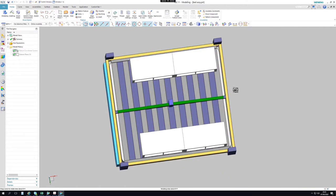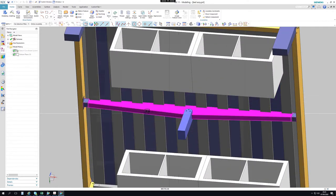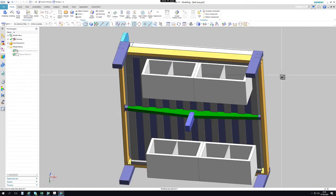We've got full length slats which run from here to here, and the central beam that supports the slats. What I've done is run the slats across first, and then I put this beam and pushed it up against all the slats. Then I put the joist hangers on, making sure the joist hangers bottom out, and put the screws into this item from the joist hanger and in the sides to the central beam as well. It's a very, very solid design.